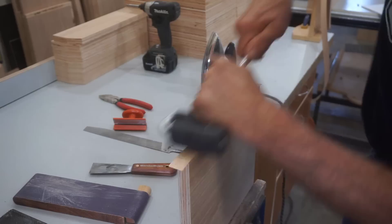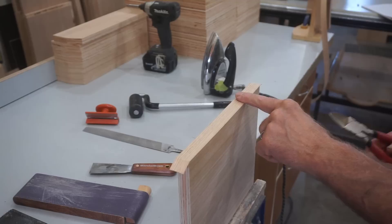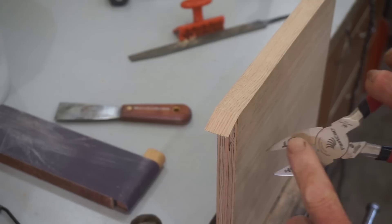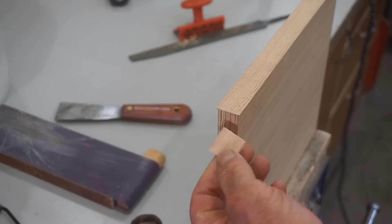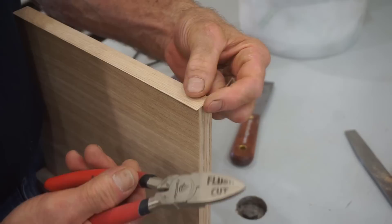I'm just giving it medium pressure. When the edge banding is too hot to leave my hand on it, I know I've got enough heat in it. I use firm pressure on the flat surface, and then I'll rock the iron on each edge to seal the glue down at the edge, then give it a quick little rock on each end. This tape is really quite hot. I take the J roller, give it firm pressure on the flat and then a little roll on each edge just to seal those edges down, because I don't want them to flake off later. By the time I'm done rolling, the glue is cooled enough so that it's stuck on here.